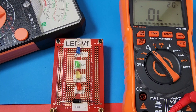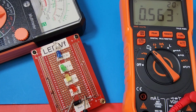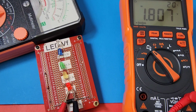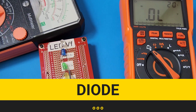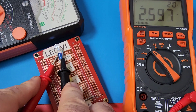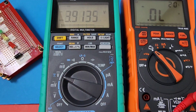Quick look now at a diode — light-emitting diodes and regular diodes. Starting off with a standard diode: forward voltage drop. We do not, however, have that nice audible beep. Over to red LED — good with the voltage drop. Yellow lit, green lit with a voltage drop. Same thing for blue and white. Excellent. Look at that — almost 4 volts: 3.91 volts maximum output voltage in diode mode.